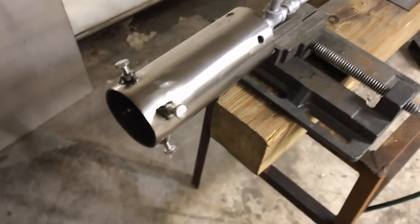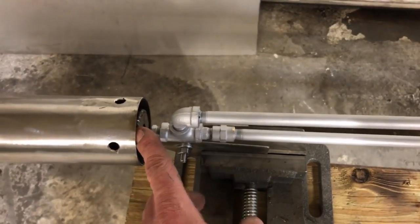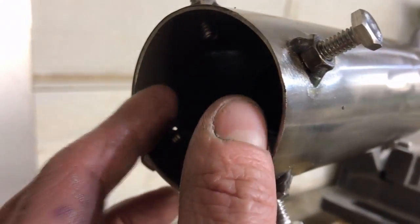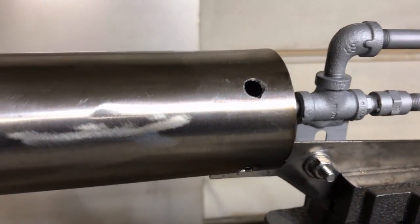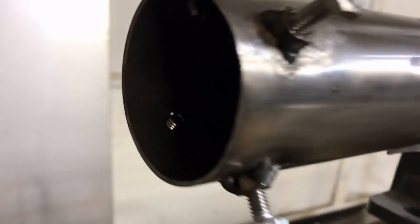The burner is set back inside there a little bit. And basically what's gonna happen, Mike, is this burner runs at red hot temperatures. So what you're gonna wanna do is leave the burner sticking off the intake about 1 inch, maybe just a half inch, so that the flame pulls secondary air in with it. And that way the red hot burner will preheat that secondary air.